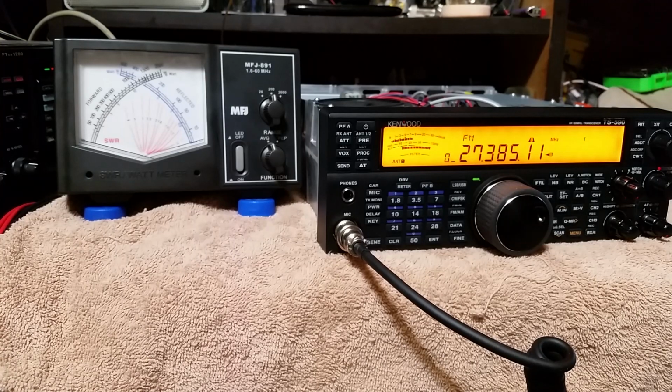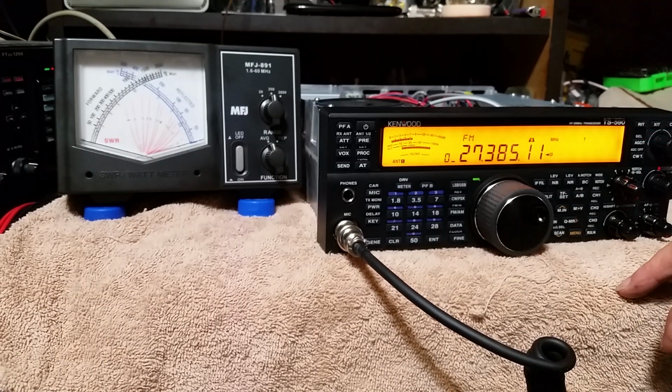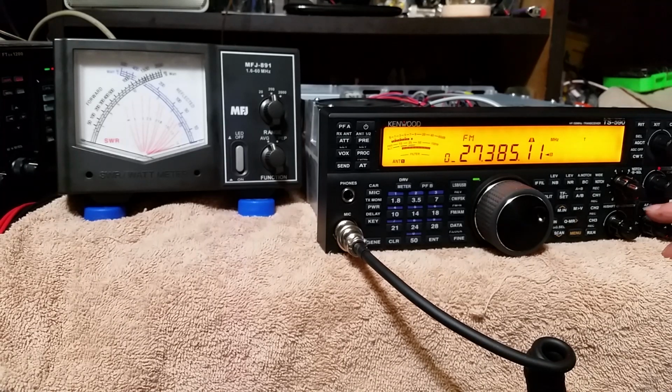But it's my rig, so I don't care. I'm just gonna kind of do it down dirty and mean. I'm just gonna put a switch on her, and it's either gonna be ALC or no ALC. I can still control my output power up front, so it won't be, per se, balls to the wall. But I will have an ample amount of power to drive older tube amplifiers, which require 100 watts or more to drive them.